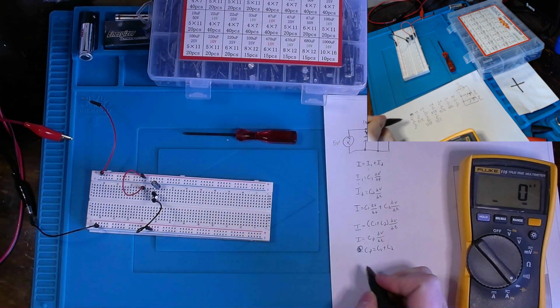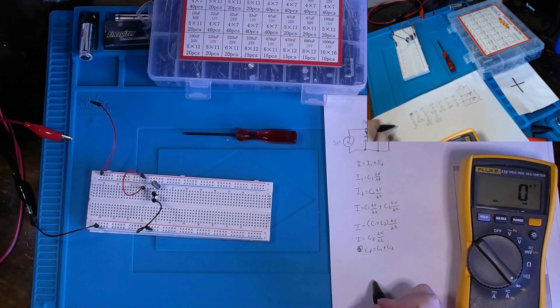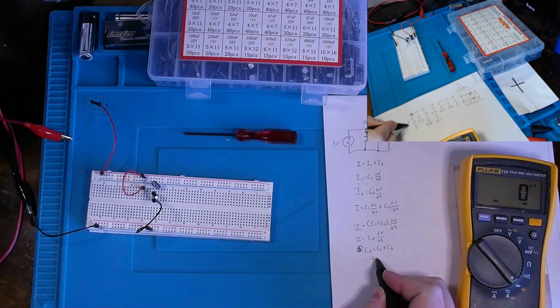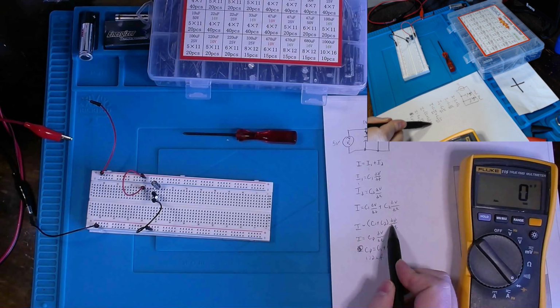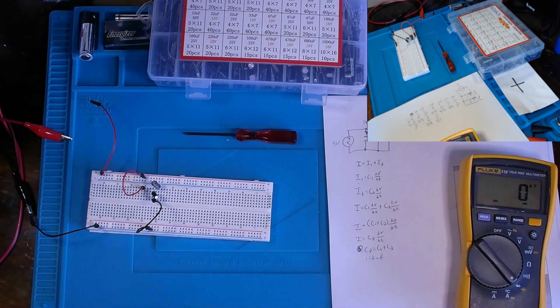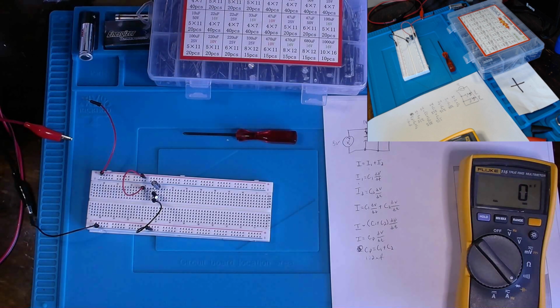So essentially, because we don't have a difference in voltage over difference in time, we're not in an AC circuit, we'll negate this out. But as part of a component, you're essentially saying that 100 plus 22 is 122 microfarads in circuit, which would be true. And then our current, because this is 0, well, 122 times 0 is, of course, 0, because there is 0 difference in voltage, 0 difference in time.